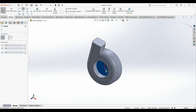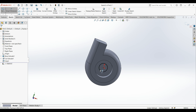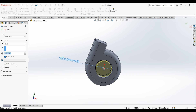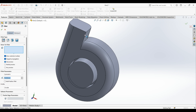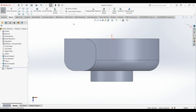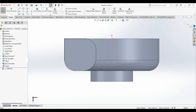Select this face again, draw a circle in the middle — diameter is 40 — and then extrude for 25 millimeters. Also this one is 12 millimeters fillet. Now select this face, sketch, convert entities, select these two corners, then add a sketch fillet of 12 millimeters.